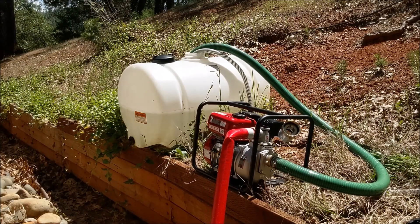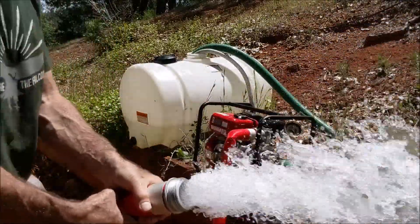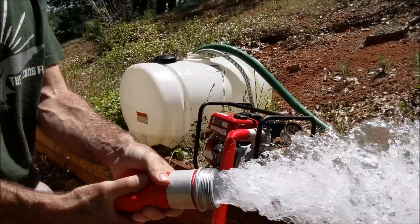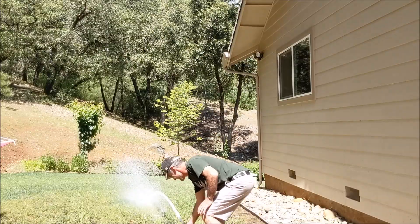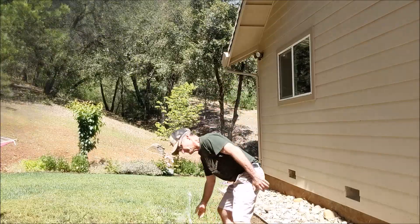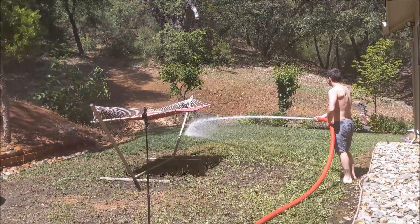On the Predator — 158 gallons per minute, 212 cc's — the problem is if it pumps 158 gallons per minute, a 65-gallon tank is sucked dry in 30 seconds or less. Originally I thought this would be a great fire pump for my truck tanks, but there's no way to minimize the flow — even at idle it drains the tank in no time. I'm going to keep the little Honda in the truck for tank use, and hook the Predator up to hydrants instead. It puts out a tremendous amount of water — incredible.